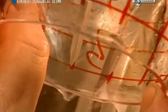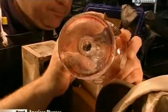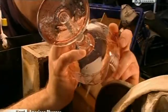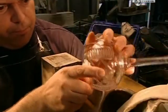Water cools, lubricates and cleans the area during cutting. There are two types of cutting, wedge and flat. Wedge cutting creates the deep, intricate cuts. Flat cutting creates smoother, less angled cuts. Here, they use the wedge method, which can only be done with diamond-tipped wheels.